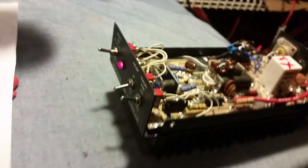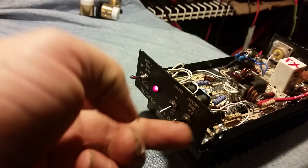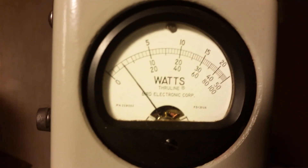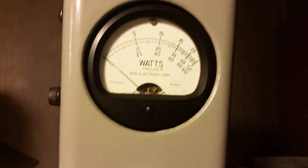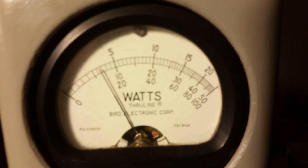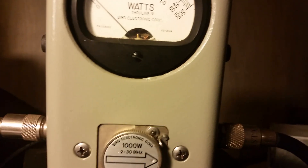All right, four-watt radio. We're in PP mode, which is up, which is low. As you see, no dead key at all. Right there about 50 watts RMS. We'll go over to high — right there about 80 watts RMS.